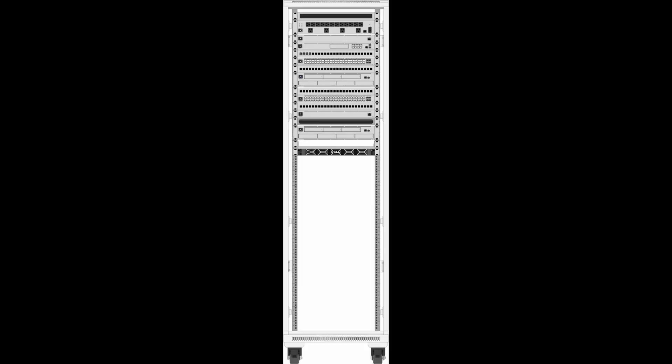Based on the equipment we're going to be putting in our ultimate smart home, we won't need nearly a full rack, but there is a lot of cabling coming in and I like having room to expand, so we'll go with a full 42U rack. Inside the rack we're going to have our network gear and other equipment to help run the home. First we'll have an internet connection — a cable modem on a 2 gigabit per second connection provided by my ISP.